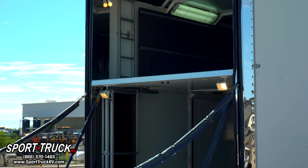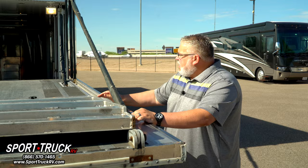It does not have all the herky-jerkiness of a hydraulic liftgate, if you have a newer operator or something like that. It runs off a 220 motor located up top there — very, very smooth. There's no need for the back roll-up door on a Renegade liftgate because the door seals up really, really well to the back wall, and there's no reason for dust and dirt to get inside.